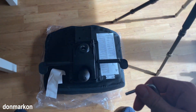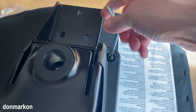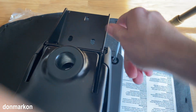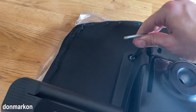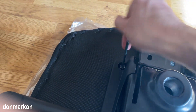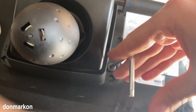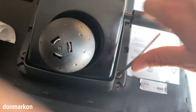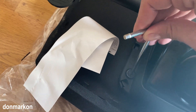Before you tighten these screws, here is an important tip: when tightening screws anywhere there is more than one screw, always first tighten them just a little bit until the thread is nearly at the end but not completely. If you tighten one completely first, there is a huge chance you will have trouble tightening the rest. First tighten the screws as far as they go without too much resistance — trust me, this will help you throughout life when doing DIY jobs.